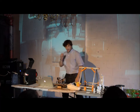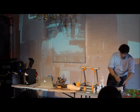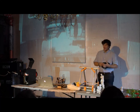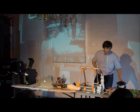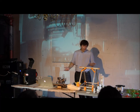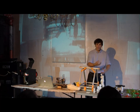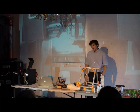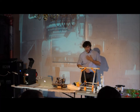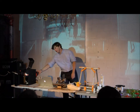As for recycling limits: PLA starts to absorb moisture pretty quickly, and once it does the material is compromised and starts coming out poorly. This is relatively new technology — we haven't really hit that limit yet. Eventually somebody will hopefully document printing the same piece and throwing it right back in the machine to see how many times it can be done. With the machine we have, we've done it about three times now with ABS material — it's a bit more user-friendly for recycling.